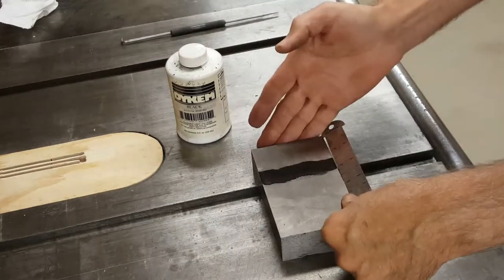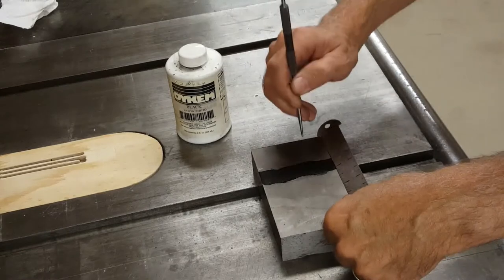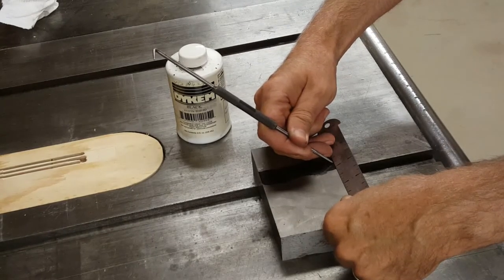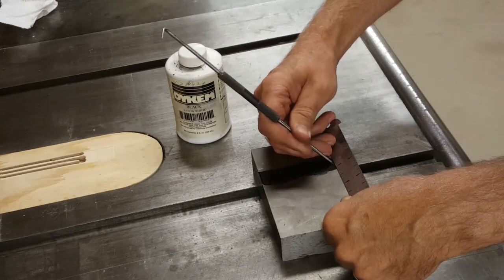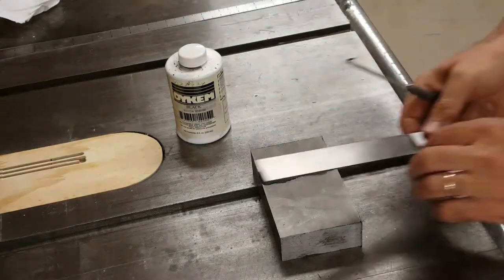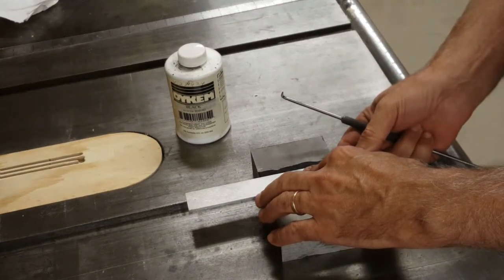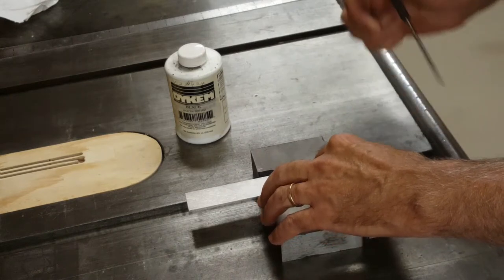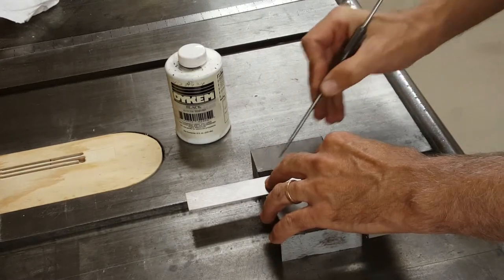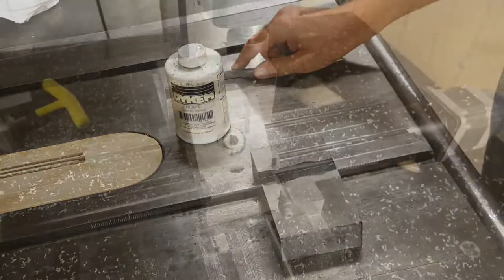Because of the way this end is cut off square, this is actually the short end, and that's the end I'm measuring from. I'm not actually going to cut on the line with the saw because I need some margin for machining off the rough saw cut. Probably end up cutting it about 1/16 of an inch longer. I don't want too much metal to have to remove though, because my mill is not a big powerful one. And cutting steel like this will go pretty slowly.